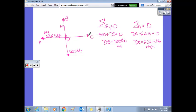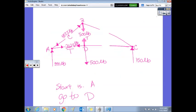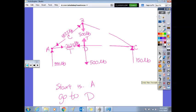Well, pretty important once you draw an arrow on here. Go back to the original and draw an arrow on here. That was this one, right? Yes. This is telling you, based on the forces that are being put on each member, based on the force, like the 500 pretty much put on it, based on that 500 force, how much force is happening on each individual part. And then what you can do further with that is knowing the material it is and understand the pressure.